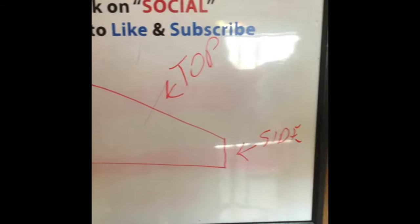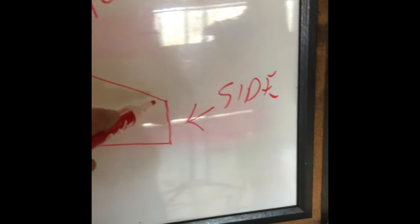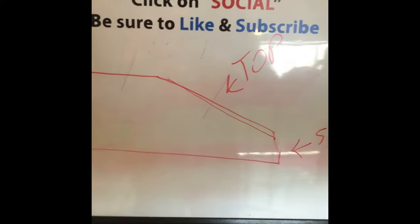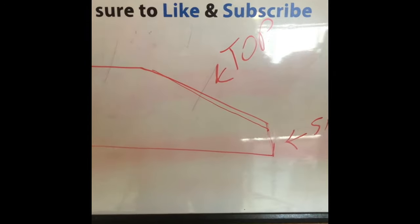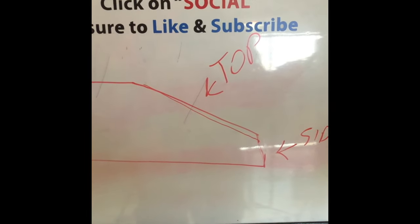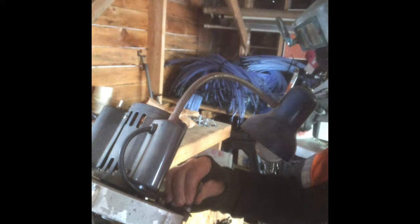Changing that slight little angle of the dresser, we might shave off and make it slightly this way, and that's going to change your side plate. When you change your top dresser you're going to be changing this slope — that's going to be your top plate angle. The side plate angle is that five degrees forward, and then your top plate angle is pretty much 15 degrees. It looks more blunt at first glance — and it is — compared to a round file at 25 to 30 degrees. Square ground top plates are around 15 degrees.